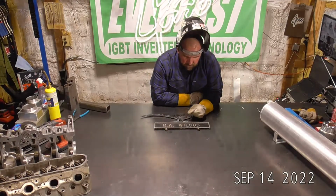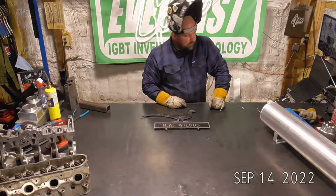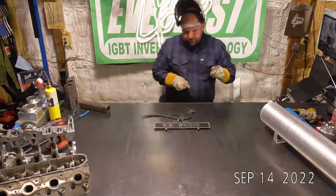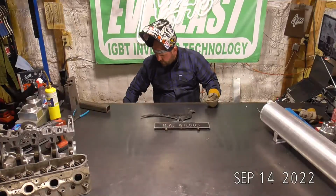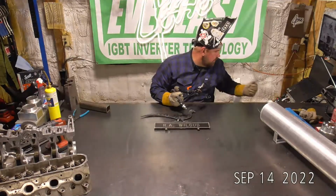It's got a lot of grooves where I can't get any abrasive down into it. So it's going to be dirty. I can see there's some remnants of old paint on there that we're going to be burning off. But also, going up in balance will pull some of my heat input. And I've actually got this 035 aluminum MIG wire. What I want to do is run real light amperage and tack this up first, just see how it's going to go before I try to put some big filler rod to it and have to use a bunch of amperage. So let's see how this tacks up.